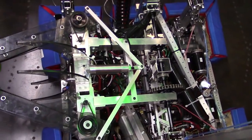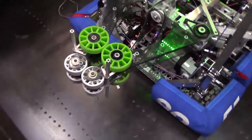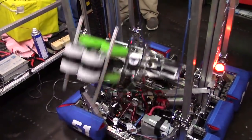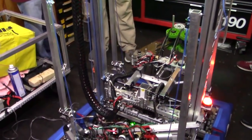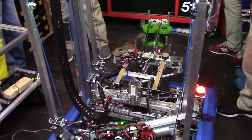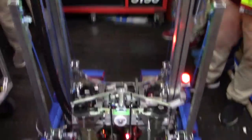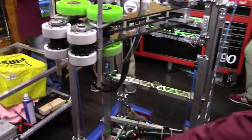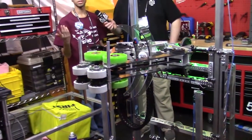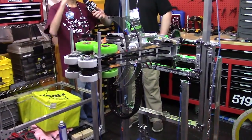We use a lot of automation on this robot. We have a bunch of presets on our controller that take it to specific heights. For example, if I want to intake a hatch out the back, I just hit one preset, and it makes sure the elevator's all the way down and then flips the arm. When I want to place on the middle level of the rocket, I hit one button, it zeroes the elevator, flips the arm through the robot, and then goes to the correct height. This is basically how we use automated buttons to take it to separate heights.